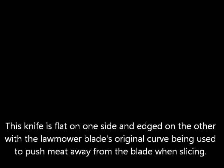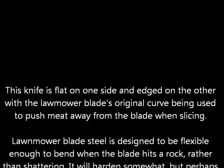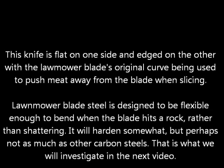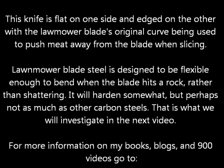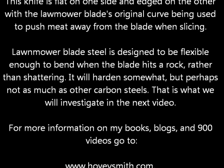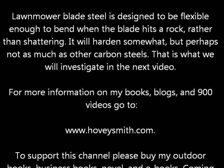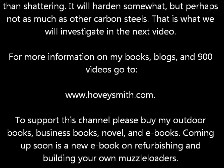This knife is flat on one side and edged on the other, with the lawnmower blade's original curve being used to push meat away from the blade when slicing. Lawnmower blade steel is designed to be flexible enough to bend when the blade hits a rock, rather than shattering. It will harden somewhat, but perhaps not as much as other carbon steels. This is what we will investigate in the next video.